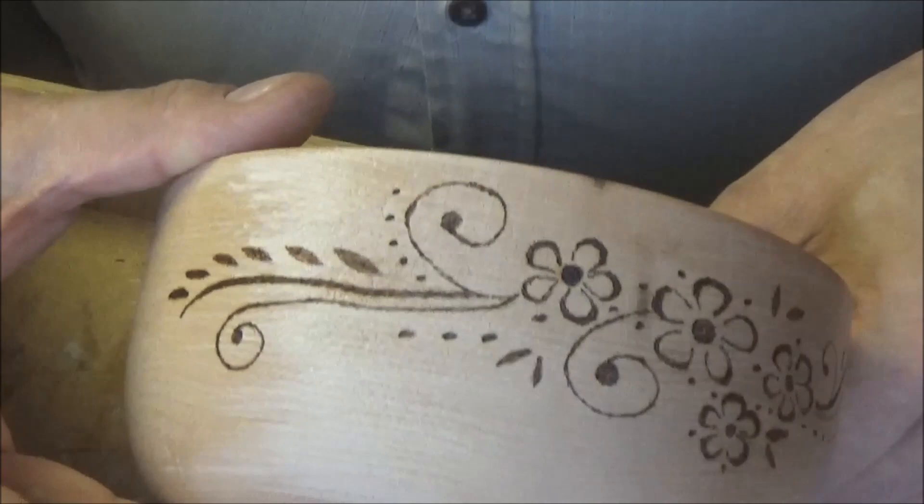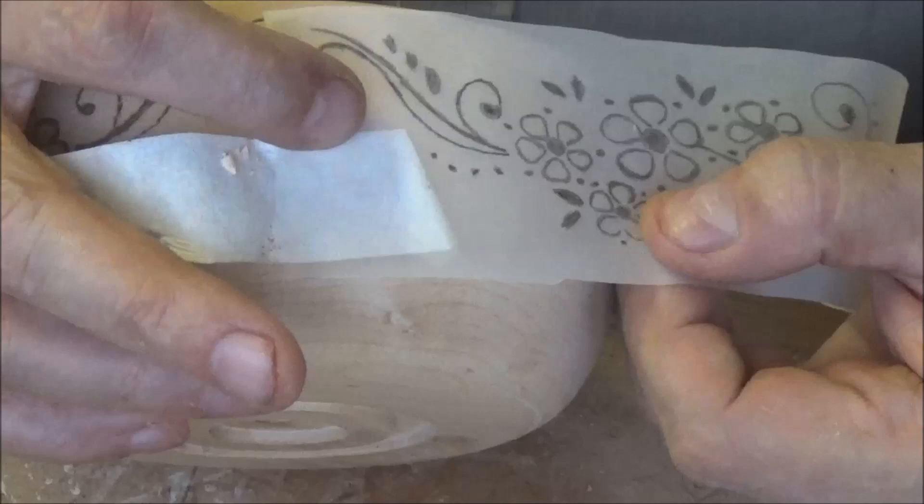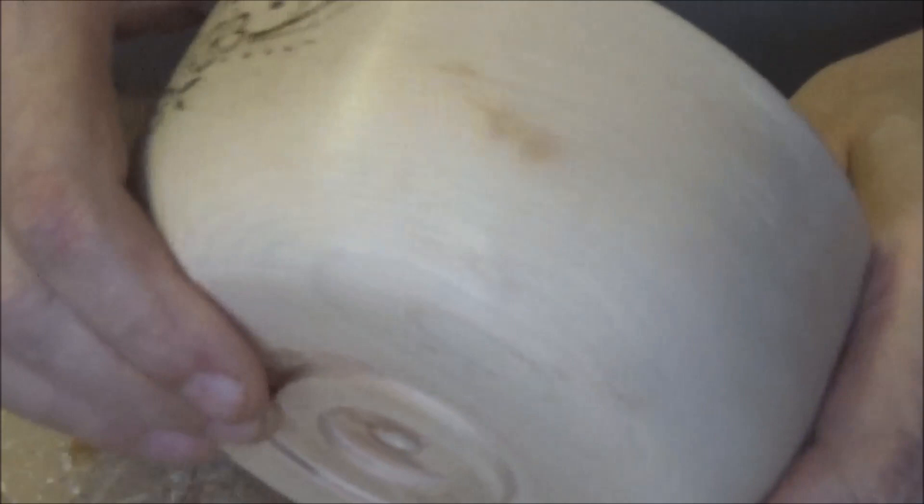What I've got to do now is reverse the pattern of the paper and put it on sort of there and take it round the bowl — it'll go about a three-inch gap at the back, which will do nicely. Don't want the pattern too tight. So I'll do the same thing all over again, and then I'll take it back on the lathe — sanding sealer, 0000 wire wool and polish — and I'll show you the finished article.